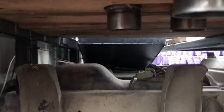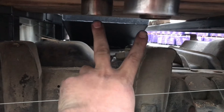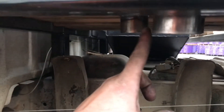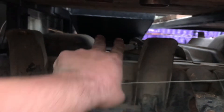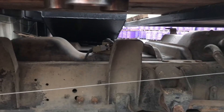Another reason I set it up that way — you can see there is lots of room to get those gas pipes staying nice and tight to the bed, right underneath the frame rail, right back to the rear condensate tank. Here's the drain right here — I'll just have a cap, and it'll be black so you won't even notice it sitting here. I'll have 90 degrees going that way, 90 degrees right there, straight back and hooked up.